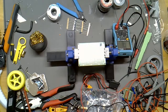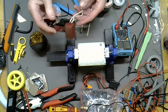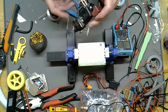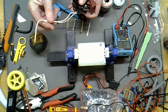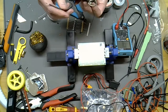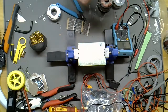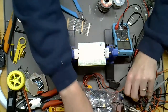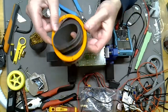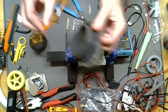Oh, don't worry about missing the start. What happened at the start? I had the switch from the Kirby, and it turns out this switch is magical, and it's not a simple switch. I was hoping that at some point these two wires would just be connected, but they're just connected all the time, which I'm guessing is a third wire at play. So I will look at alternatives for using this switch until I can do some research. But that's okay. The other good bit is this 3D printed prototype fits onto this bit, which means now I can get on to making the adapter for the battery to go in the bag of the vacuum cleaner, which is good.